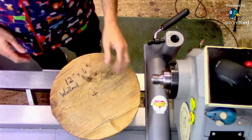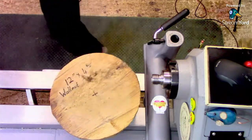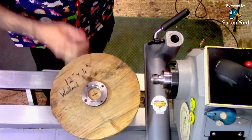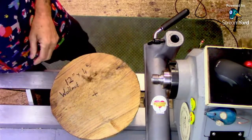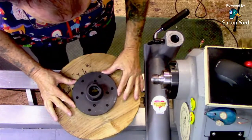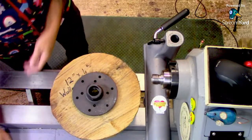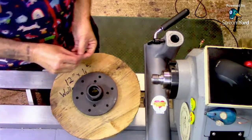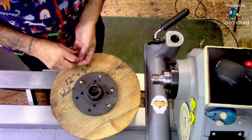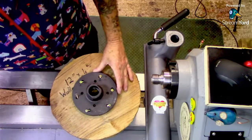Because it's 4 inches deep and 12 inches across, I felt I needed something more than just the ordinary. I normally use a faceplate ring, but I thought — hmm — might need something a bit more than that. We came up with this idea: we're going to use a faceplate ring that came with the lathe, never been used. We'll stick six 30mm screws in here, and if it works itself loose, we'll stick the other four in.